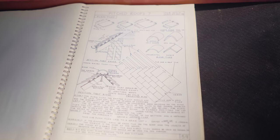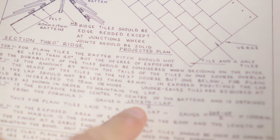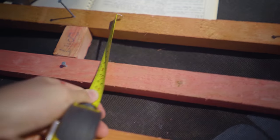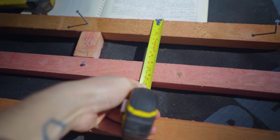Let me show you this equation. Page 59 of the Bible. It says: gauge = (length of tile − lap) ÷ 2. So with the 70mm lap we want, it gives a gauge of 98mm — center-to-center of the batten. I always like doing top-to-top rather than center-to-center because you've got something to hook on. That gives 99mm, and one mil between friends — we'll let that slide. I haven't nailed this one on yet.